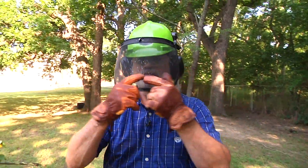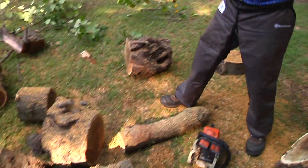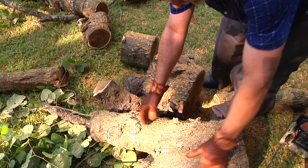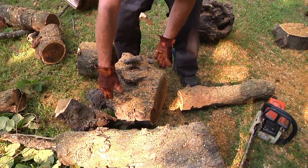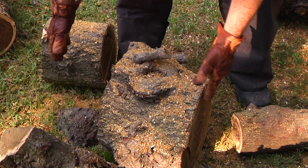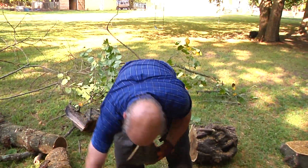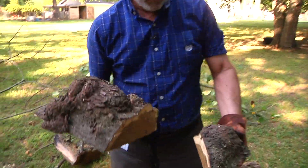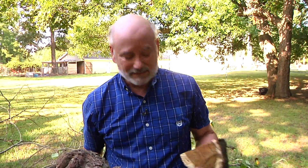From the looks of this, it's either raining or I'm trying to make a dirty phone call. That's a lot of work — it doesn't look like it, but it really is. I still have to cut this branch off to get this crotch here. When you're cutting a tree and wanting to make straight bowls from it, you want to make the log at least 20% longer on the ends, because if the wood starts to crack — which it will no matter what you do — it will go into that wood and you'll waste that whole piece. The other thing I was doing differently was trying to save the burls. Why cut a big log and keep the whole log when all I need is this part right here? Next, we need to seal up all this end grain so the water doesn't leak out and cause cracking.